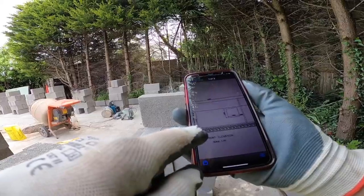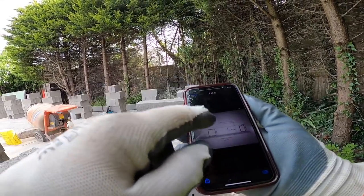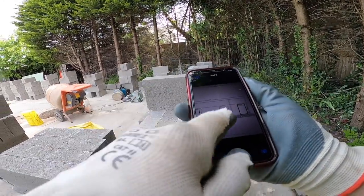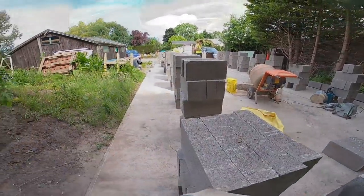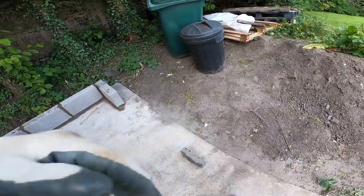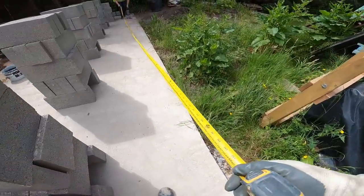And then the window just after the storing wall. So we just need a rough measurement for this. It's a party wall, if you like. So 1200. Okay, you always put your brick on the inside, so it's inside your opening, so you bang up to it. And if you always put the brick in the same place, you won't make mistakes like that either. Yeah, 6540 is right.